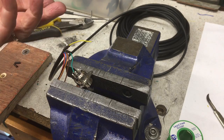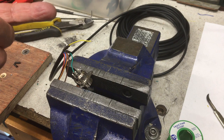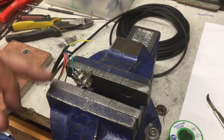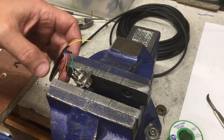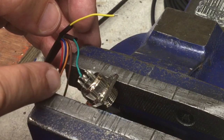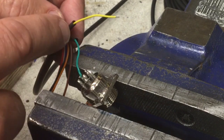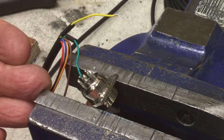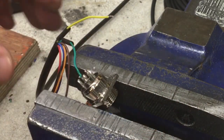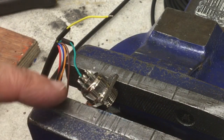Although this isn't the best cable to use, it's everything I've got at the moment — I don't have any screened cable left, just a little bit that came with the encoder. We'll see how we get on; if I get interference or problems, I'll swap to screened cable. For now I've got this 8-core cable — pretty small gauge, but then these 7-pin connectors are pretty small anyway. I've put solder in each of the little solder buckets at the end of the pins, with some heat shrink around them. It's really fiddly — just take your time and get through it. We'll put heat shrink over the whole lot to make it neater.